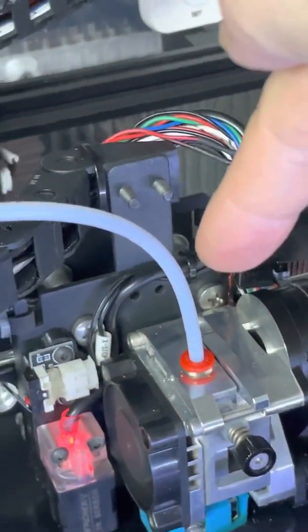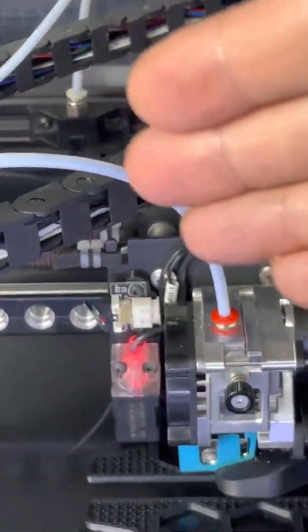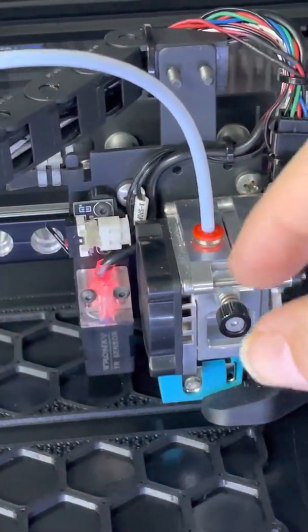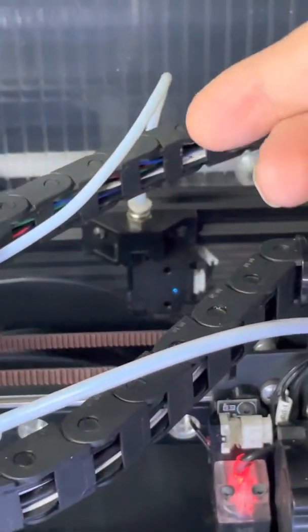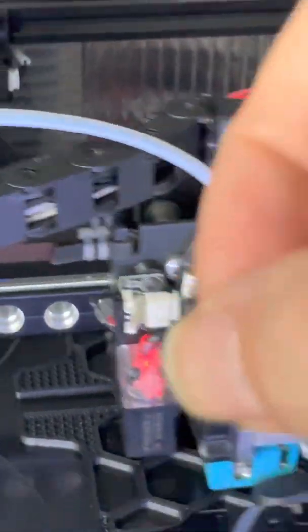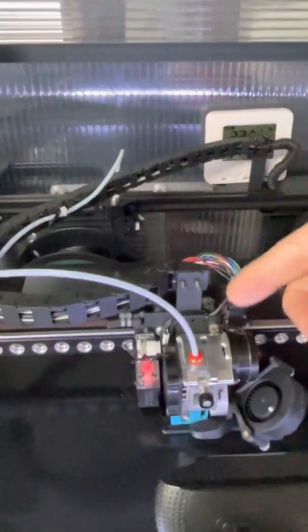The NF Sunrise bolts onto the standard mounting holes used for the original hot end. Now the original hot end also has a Bowden tube, so at first glance you might think, oh what's the difference? Well there's a big difference. The direct drive extruder feeds the filament directly to the hot end — the distance between the feed gears and the melt zone is only a centimetre or two. The original printer uses a gear extruder pushing filament through a long tube, and that's like pushing a rope uphill. You never get the accuracy needed for good quality prints, and you'd always see stringing where filament continues to ooze from the nozzle as it travels across the print. So I recommend going to a direct drive setup.